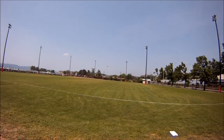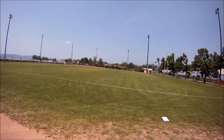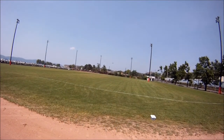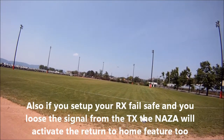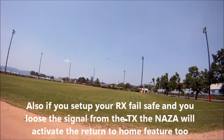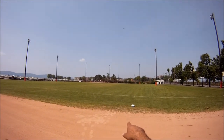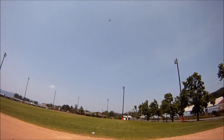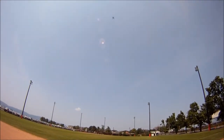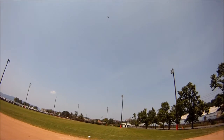Let me wait for the train to go by. It's in altitude hold again, and now I'm going to click the failsafe switch — that's gonna activate the return to home. The yellow light is gonna blink a lot, which means it's in failsafe mode. The aircraft is supposed to go up 65 feet, and that's what it's doing right now. Then it's going to fly back and land around five feet from the original spot. The aircraft is turning and coming back to its original position — you can see it right there.